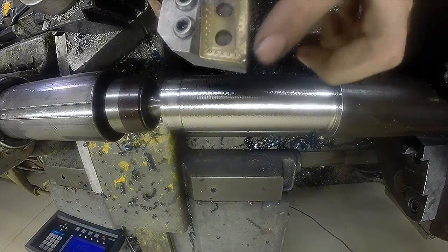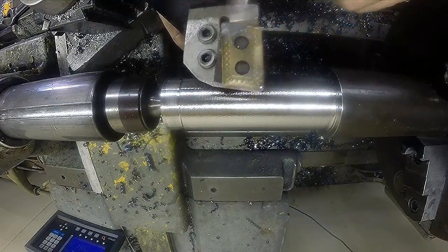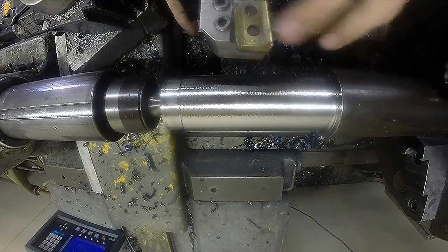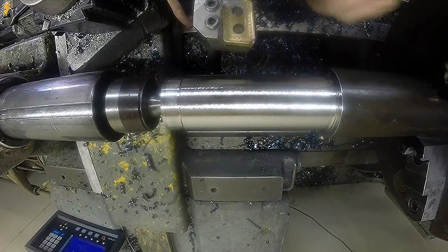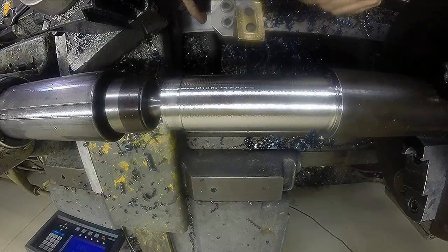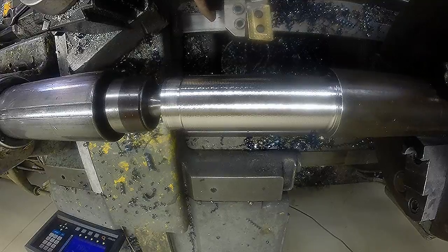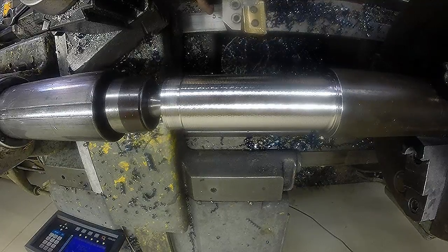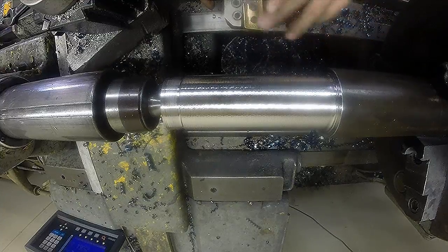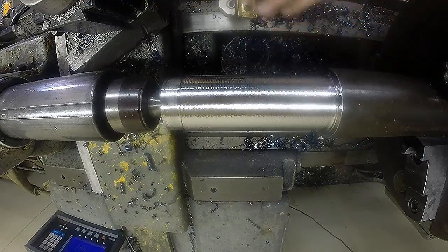See the edge there? It's been bothered a bit — you can see where the power went out and it did bother it. Took that corner out when it backed up and shut off. Should have had the right heaters in the motor starter and that wouldn't have ever been a problem — something I've been meaning to do. This is the first time I've pulled enough load on this lathe for a long enough period of time. It's 92 or 93 degrees in the shade, which no doubt contributed to tripping that out. But that's what you learn.